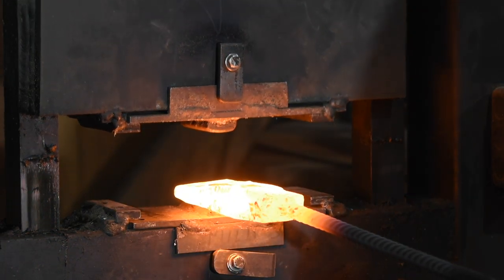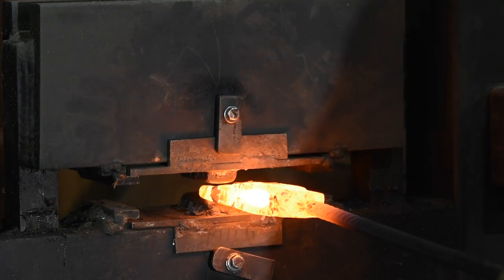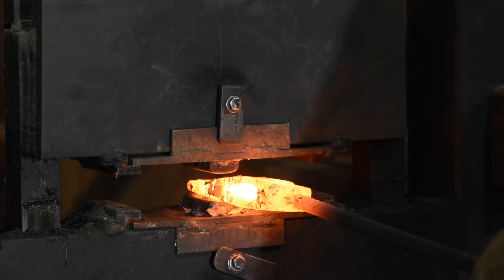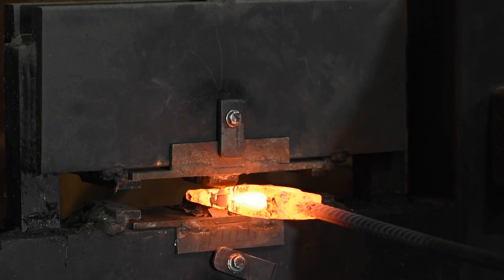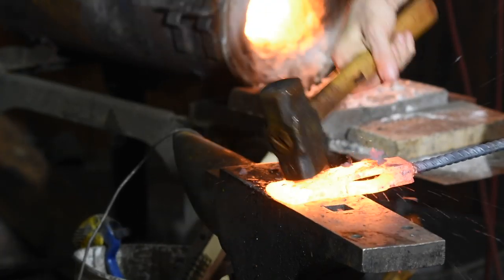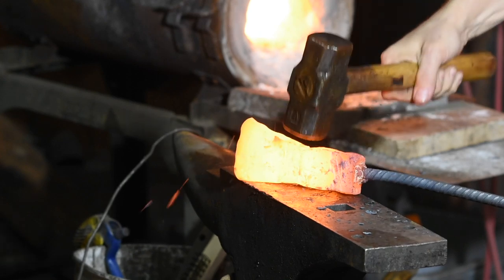Next, I'll do some preliminary shaping of the blade. For that, I'll change dies on my press. I want to expand the width of the blade while thinning it. If I simply used a normal drawing die or a flat die, I'd end up with an axe that didn't really flare out much, and that would be — the technical word is crappy. I'll do the shaping of the blade in several stages, but I want to get the roughest work done here so that I don't have to go too hog wild after I've perfected the shape of the eye. Guaranteed, if you do a whole bunch of forging after the eye is shaped, you'll end up squashing it and you'll kind of have to redo it.